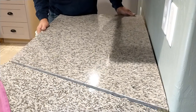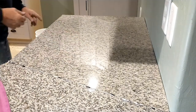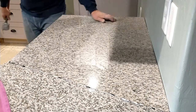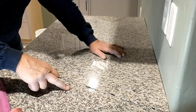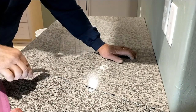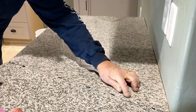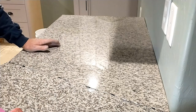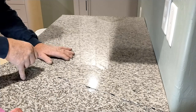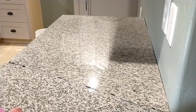Then I get the piece up on my tape and slide it in, letting the epoxy push out along the length. I give it a couple little taps with a rubber hammer, then look along the seam making sure that the crack got filled up. You want it kind of above the surface initially. It looks pretty good. I'm going to let that sit just for a little bit, and verify that we're even — though nothing would change. That's a real subjective thing — it's really hard. You might be even in one area and the other area is off; you can hook a fingernail on it.